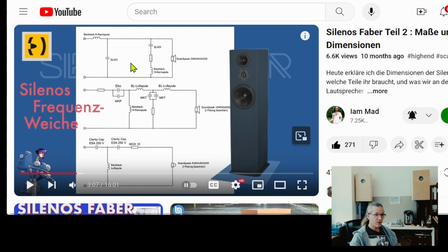And if you want to take them further, you can bypass them with higher quality capacitors. And for those of you who are the really high level freaks, the Kemet DC link capacitors mix extremely well, even with the Duelund or Miflex capacitors. Their cast copper capacitors are wonderfully mixable with DC links, and the end result will be very similar to purchasing the high value Duelund capacitor there, which will probably cost you more than your car. So that's one thing. Upgrade the capacitors, get as high quality ones as you can find, and that's it.